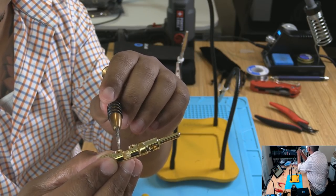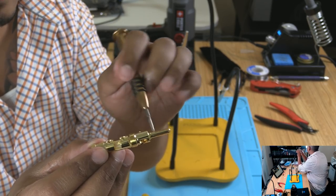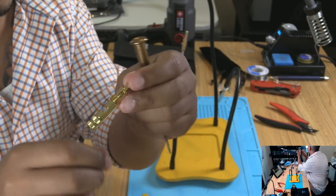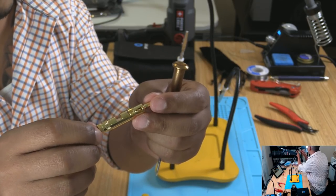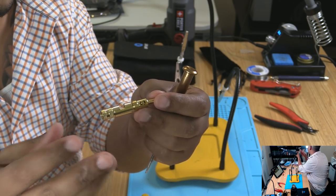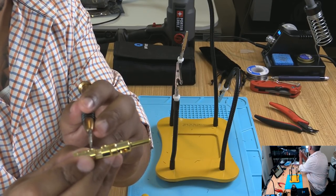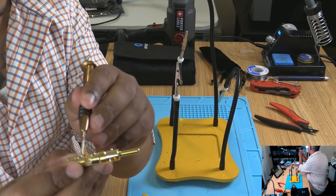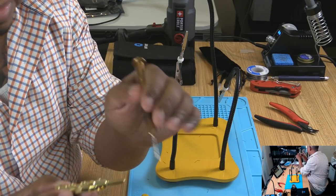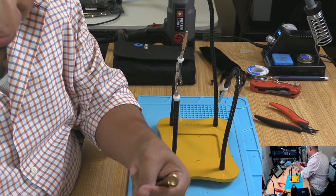This one you can just strip the entire wire and just screw in and make contact with the bare wire with both screws. I don't recommend that, honestly, because after a while, after bending and flexing for a bit, the wires will break, and then you're just gonna have to redo it. I usually just keep enough of the sheathing of the wire on so that I can screw straight into the sheathing to give me a tighter fit. And then from this point forward, I leave bare wire. So I'm gonna do that. I need to measure though to see how much I have to take out.